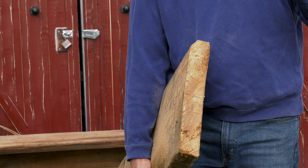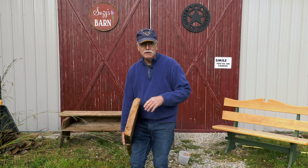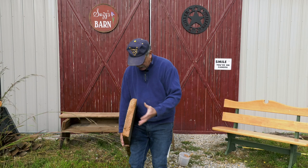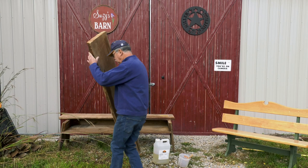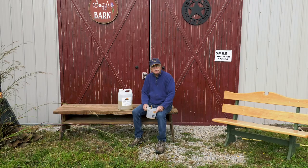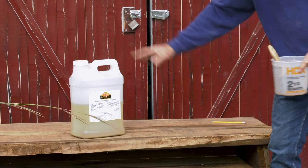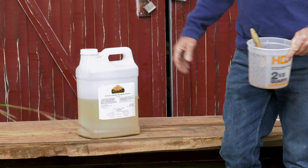If you keep it dry, that helps. A couple ways you can get rid of them: number one, stick it in a kiln, raise the temperature up to about 165 degrees for 20 minutes — let that board really cook and that kills them. But if you don't have a kiln, right here is the stuff you want. It's called Shell Guard. Shake it up, get a bucket of hot tap water, mix it 50-50, stir it with a brush, and then brush it on all surfaces and let it dry for a week. With a mask, sand off the excess, let it dry another week, and then you can finish it.